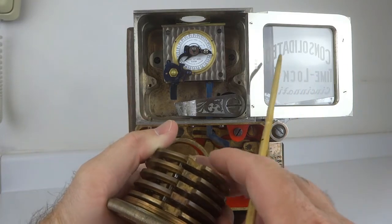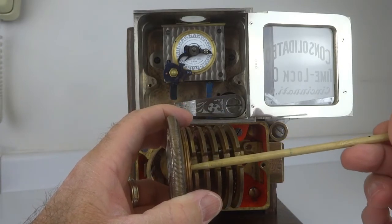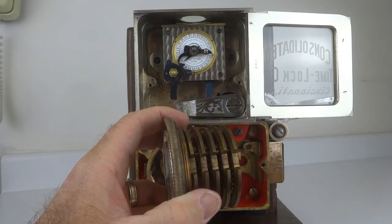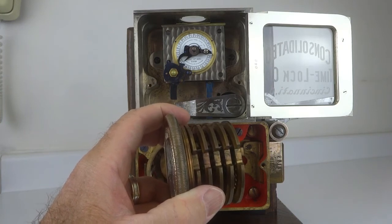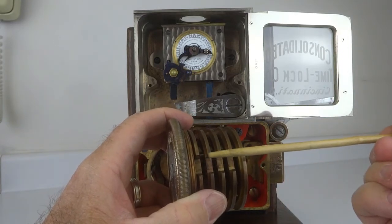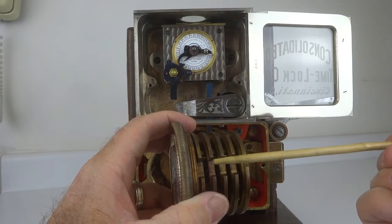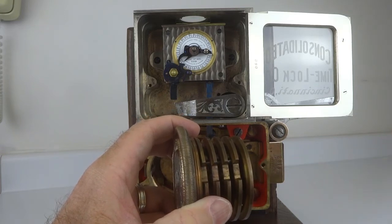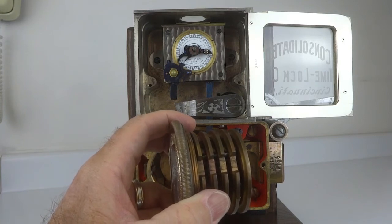And when these tumblers are all aligned as they are now, the fence can drop in, and therefore the combination lock will allow the boltwork to retract and the safe to be opened. If any one of these is not in alignment, the fence cannot drop into the gates, because one gate is not aligned, and the safe cannot be opened.